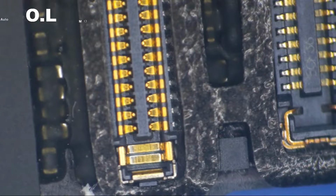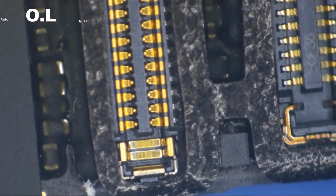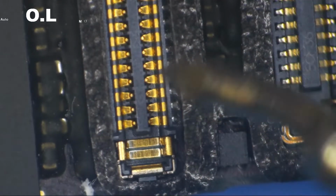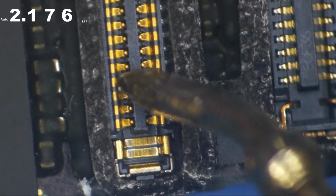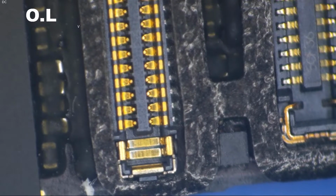So let's see what sort of a diode mode reading we are getting there. Instead of plugging the board in and testing it, I'm looking for no image problem without actually plugging it in. So what did I say, 4? So let's check out 1, 2, 3, 4. 2K, that don't seem bad, but I meant to be on diode mode. So let's do that one more time.